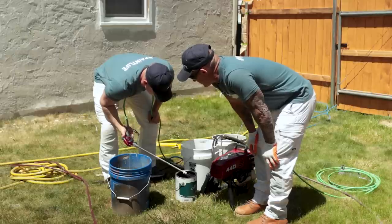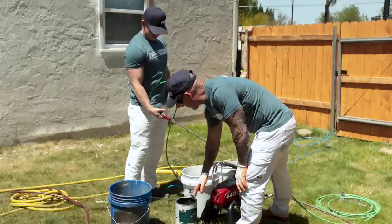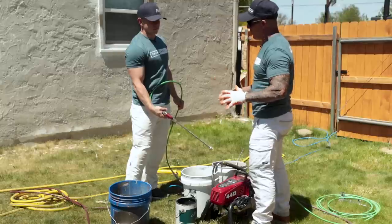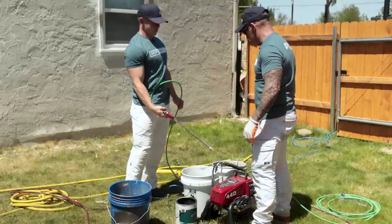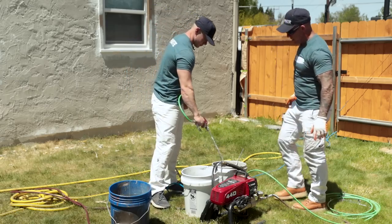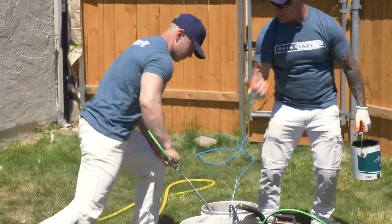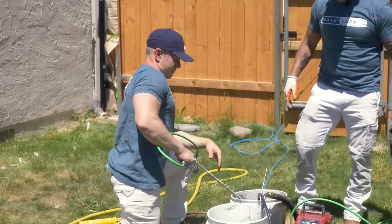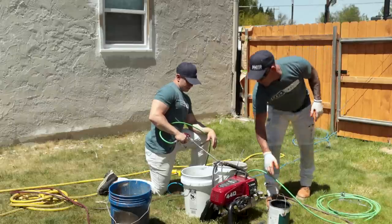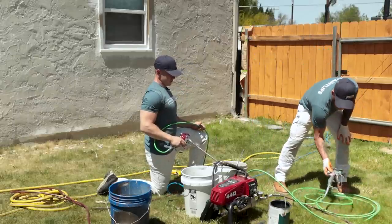It's starting to change but not yet — right about now. I don't mind getting a little bit of water into exterior paint, but for trim paint or cabinet paint you don't want any water in it because it'll make it run a lot easier. Exterior paint it's not bad to get just a slight amount of water in it. Now start running your dirty water out. Always shoot it on the side of the bucket — if you shoot straight down it's going to kick back up in your face. Run a little bit through there, then stop. We've got a second line we need to empty.